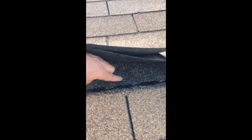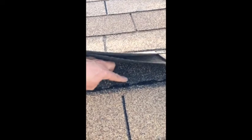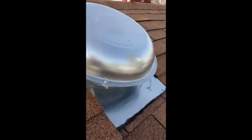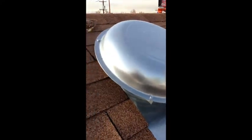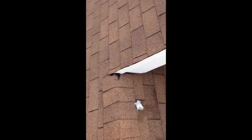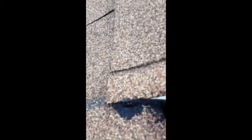The nails should go right about here. Now I'm going to go back and nail off all the shingles, make sure the tin is well nailed down, and then tar. On the end of your roof caps there are usually nails to finish the roof cap — I like to caulk those. So caulk your roof cap nails.